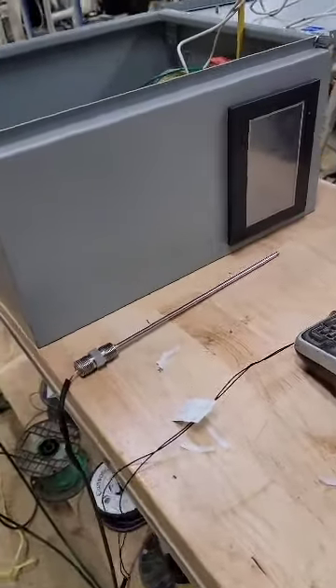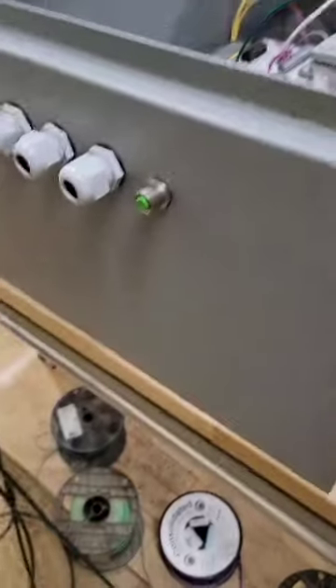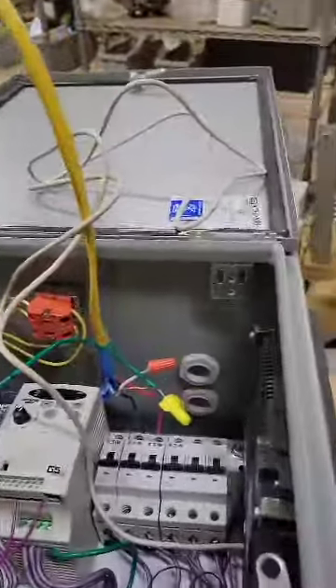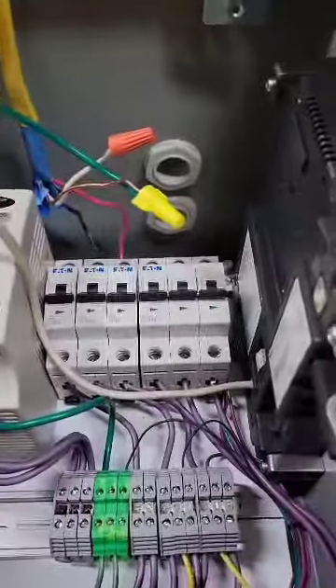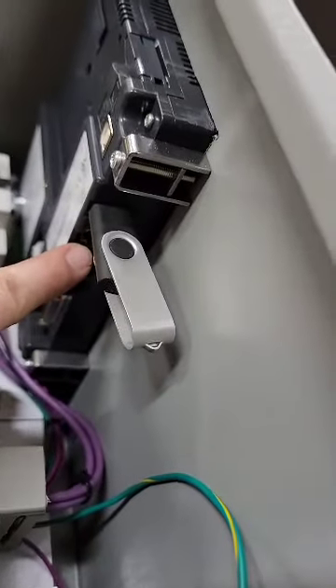Here's the overview of the machine. I did add the door port — we didn't have that before, so I added it to the drawing. I just had three originally because we added the third. When I was testing and debugging I realized we needed the door port. The machine will ship with these communicating via the RS-232 port. If you want to program the HMI to work off Ethernet, you can use that port down there, right below the USB.